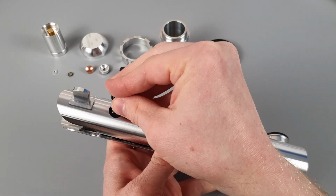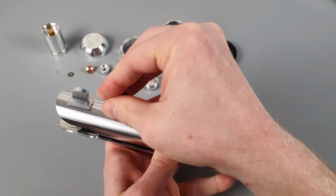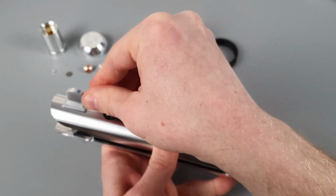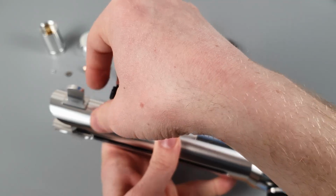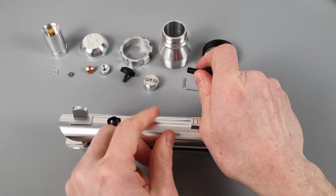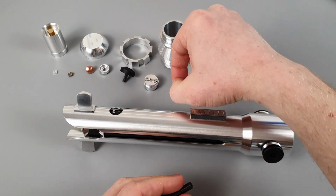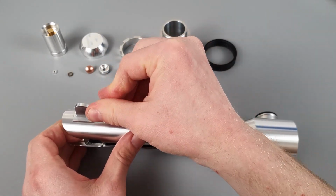Next thing is removing the pins, and for that we have a 3D printed tool. So we just put it on top here, press it down, then rotate it anti-clockwise. You really have to feel the grip that it has, and then it will work. There it is. I can just pull it out with my finger, and here it is. And the second one works the same.